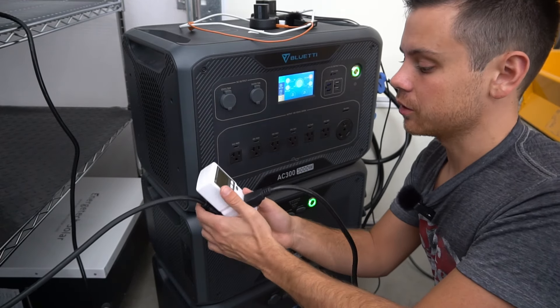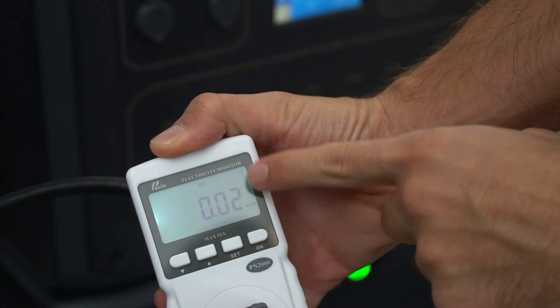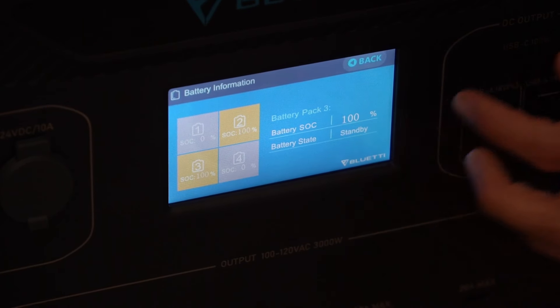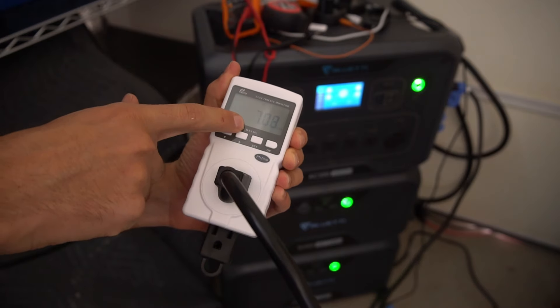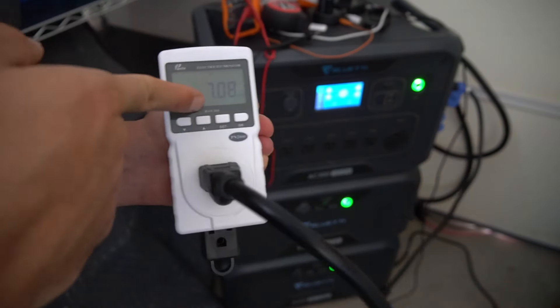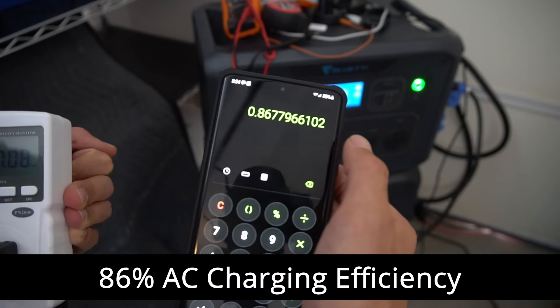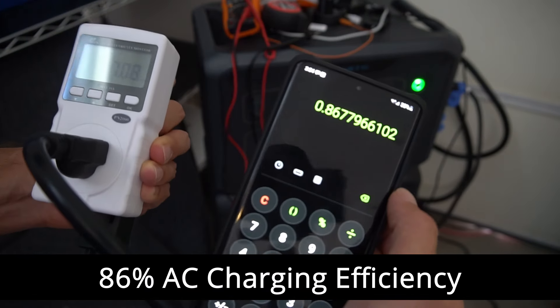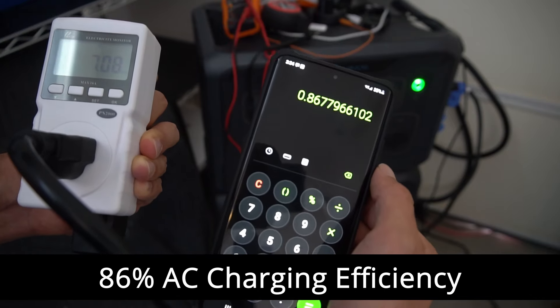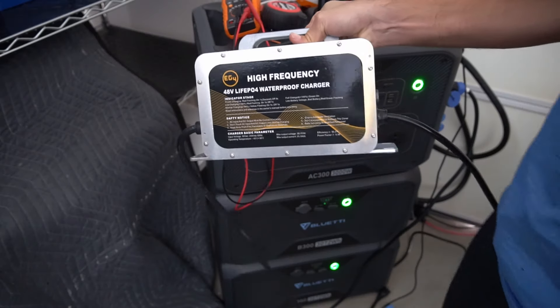The meter is zeroed out. Now both batteries are fully charged and it took 7.08 kilowatt hours to charge them. Dividing this by the total capacity, we get a charge efficiency of 86 percent, which is not that great. I actually have a battery charger next to me that pulls 95 to 98 percent efficiency, so that's a notable difference.